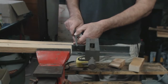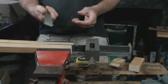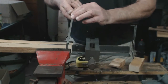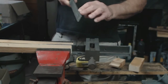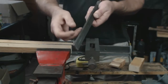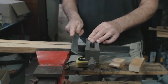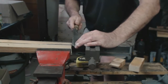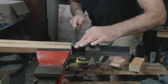The hacksaw cuts down to about 7mm. We've got the V cut down and we can now move on to our flat file. This flat file has got a non-cutting edge on the side — when you're buying a file, always look for one with a non-cutting edge. We can now ride on that surface without cutting it and cut the other surface, and then go around and expand the V like that.